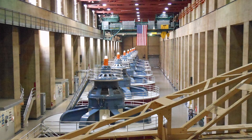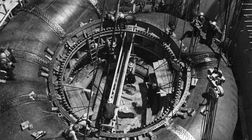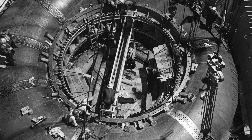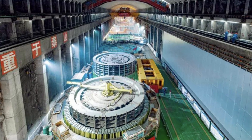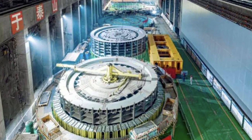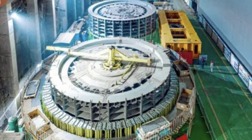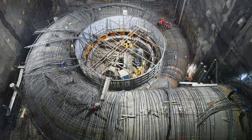As dams get bigger, so do their turbines. Newer dams, like Hoover Dam in the US, still use the Francis turbine, but with a spiral casing connecting a penstock pipe to the turbine inlets. A well-designed spiral case can provide lots of rotational momentum as the water goes into the turbine without hurting the water speed or pressure, meaning even more power. The largest turbines to go online, at least as of 2022, are the 16 one-gigawatt turbines in Baihetan Hydropower Station in China. Each turbine is 50 meters high and, with its supporting equipment, weighs more than 7,500 tons. Despite the colossal size, they're still just a basic Francis turbine with a spiral case.